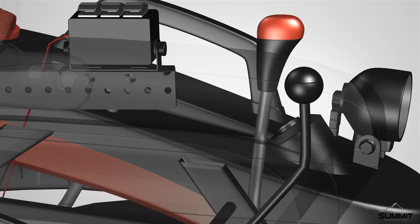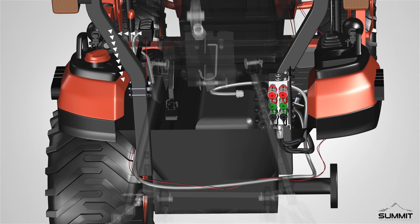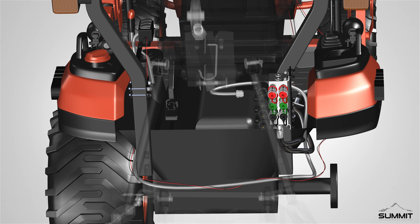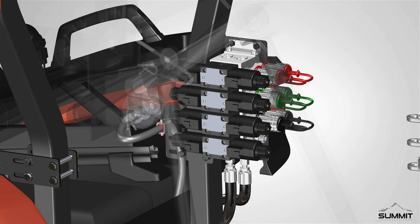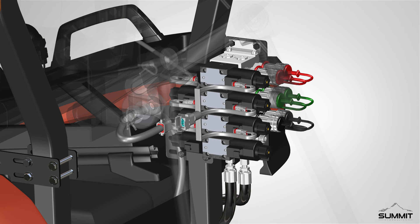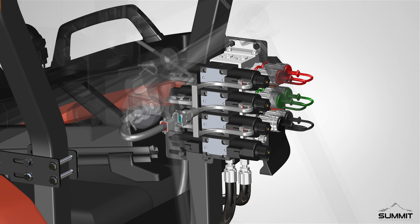After securing the switch box, route the harness cable and battery cables around the tractor as needed. The battery terminals go to the front of the tractor and attach to the battery. Properly route the wiring, and use zip ties to secure the routing in place. Take care not to pinch or cut the cables. Next, connect the plastic Deutsch connectors on the wiring harness to the valve bodies, and attach the harness Deutsch connector to the switch box Deutsch connector. The connector should easily connect and clip in place. Step 4 is now complete.